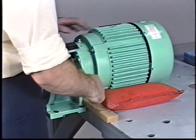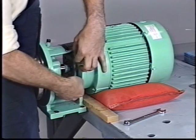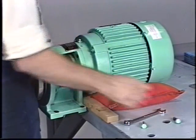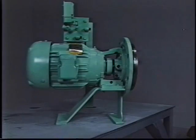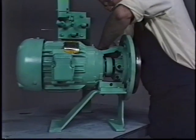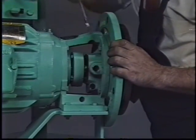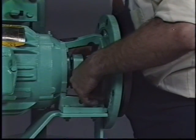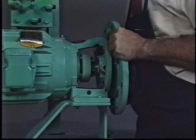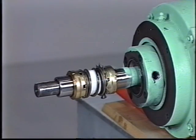With the 9/16 wrench, remove the 4 bolts securing the seal gland to the bracket and slide the gland back against the motor face. Remove the 4 bolts securing the bracket to the motor register and carefully remove the bracket from the motor. Take care not to drag the bracket against the shaft or seal. To remove the seal from models 2CB and CBS, after removing the oil lines, gland fitting, and impeller and unbolting the gland from the back plate, remove the 4 bolts securing the back plate to the bracket. Remove the back plate, exercising care not to drag the seal chamber bore against the seal or shaft. The seal and sleeve are now exposed. Simply slide the sleeve, seal and all, off the motor shaft. It is sealed to the shaft with an o-ring and will slide off easily.